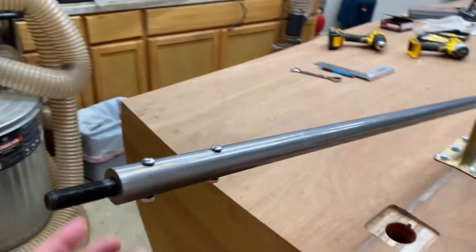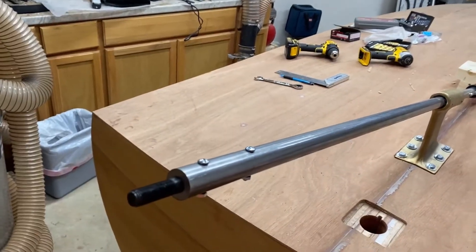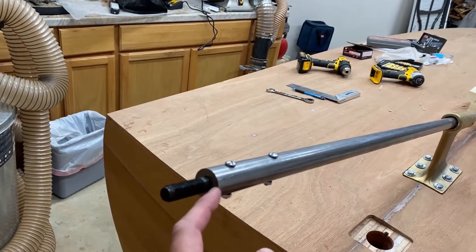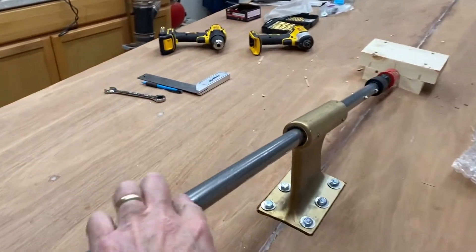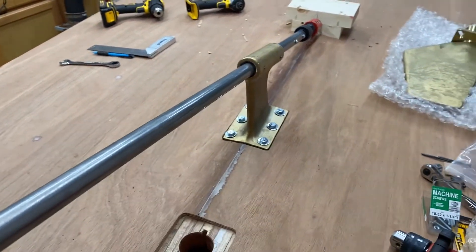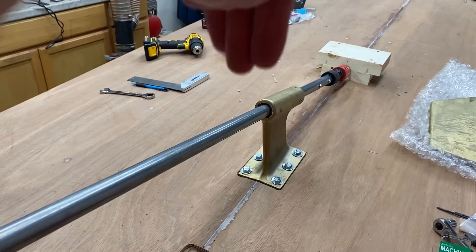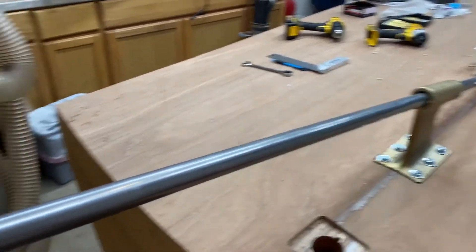What I did is I bought a steel rod - basically a pipe - but it's half inch, so it's one inch in diameter and it's got a half inch hole down the middle, so it's a quarter inch thick steel. The reason I got this one inch is because these bearings in this strut are one inch, and I plan on using a one and an eighth inch prop shaft, so I'm not as worried about wrecking those. I'll drip water on there when I'm drilling, and it fits perfectly that way.